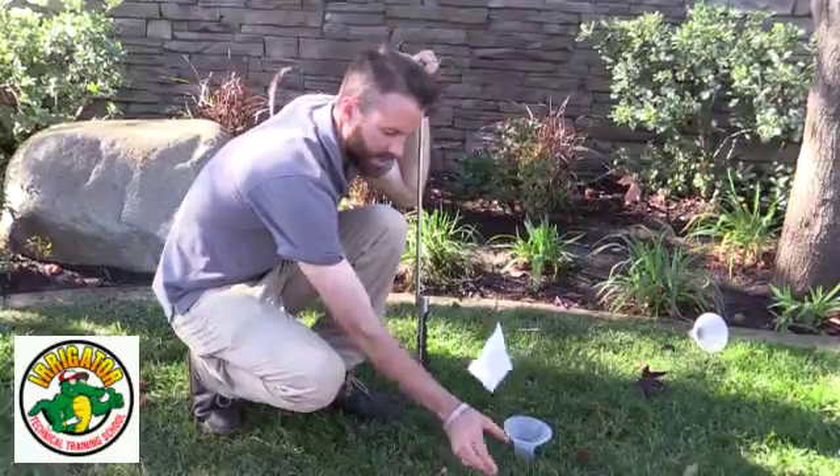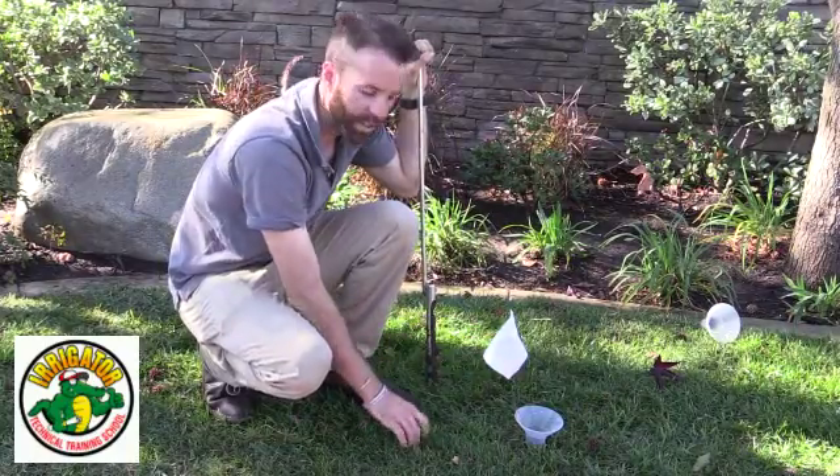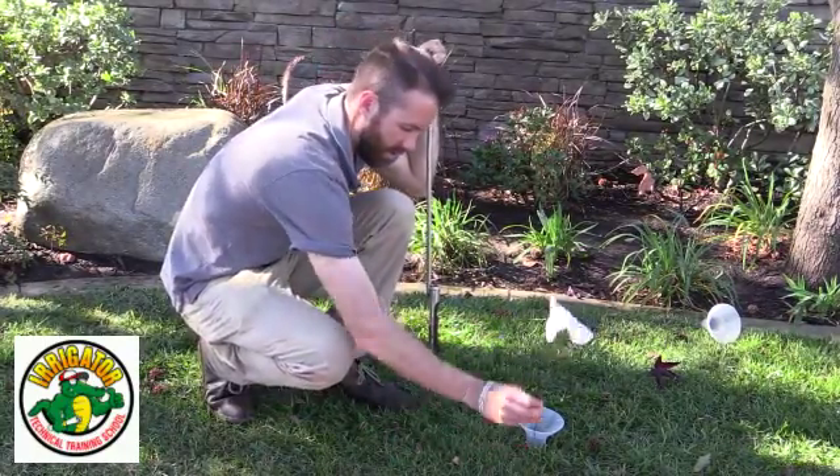Here's where my head is — I'm about eight inches away, so we want it to be around a foot in front of the pop. We have the station on and we're running it for 10 minutes, which will give us a good amount of water in our catch cans. One important step before you do this: go to the water meter and take your reading. We wrote down our current meter reading, and after the 10 minutes we'll go back and record it again to figure out gallons per minute — that's a crucial step.